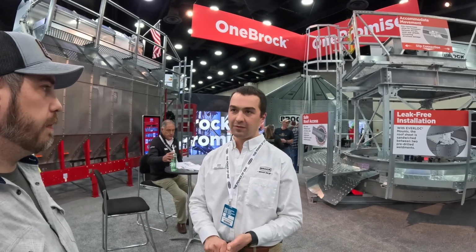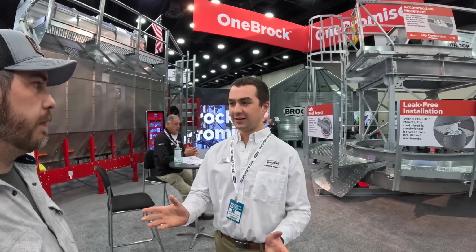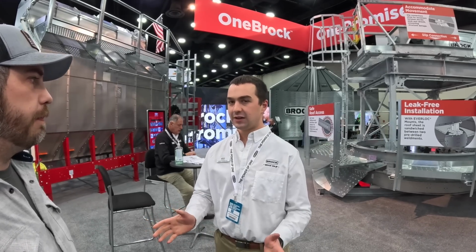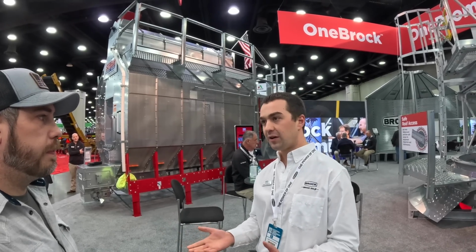In terms of grain quality, there's a lot of people that tell you that the grain quality is way better. We've had a difficult time quantifying that, and I'm not here just to sell stuff. We've run two Meyer tower dryers next to a Vector, and in terms of grain quality, all I can really say is it's a slower drying process with the mixed flow dryer, because the grain's going to be in that dryer about twice as long. So could it have better grain quality? Potentially, right? We typically smoke meat a little lower and slower.